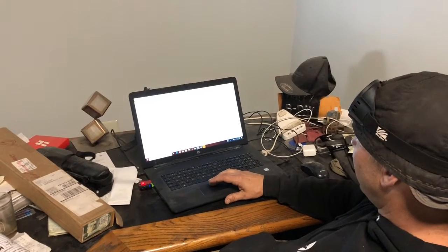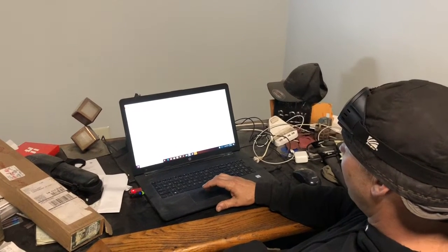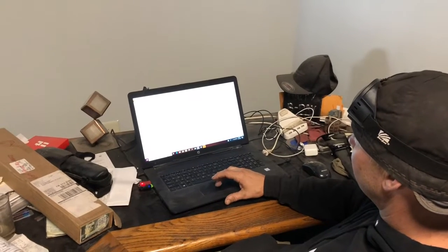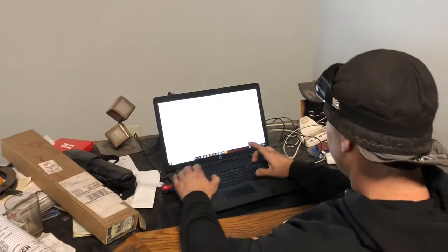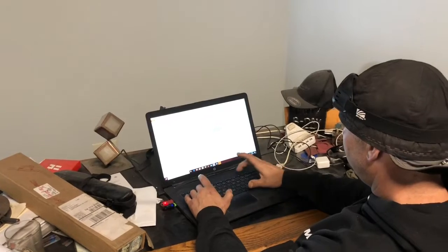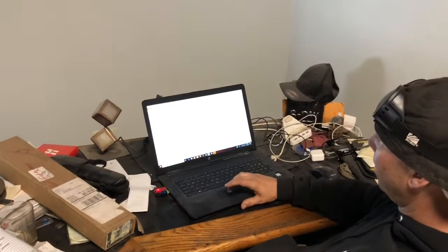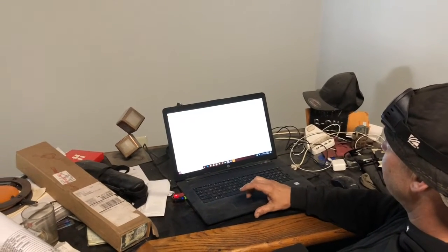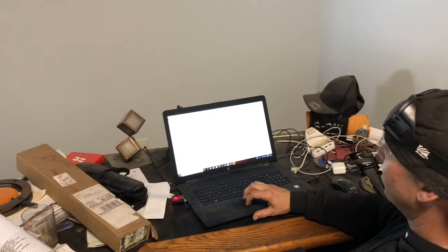And then I want to change my size to 60 because I have a 5x10 table up there, so 60 by 10 is 120. This one I'm going to do 120 and 60, and I'm going to save that. Okay, and then I can come up here and do a new nest. Or I can edit the part list. So we got our plate 60 by 120. We're going to edit the part list here.